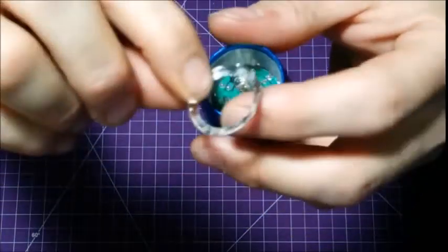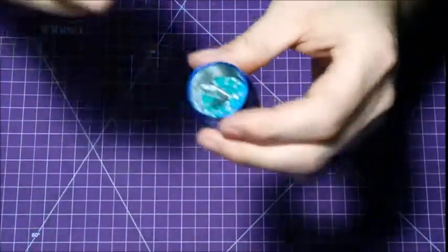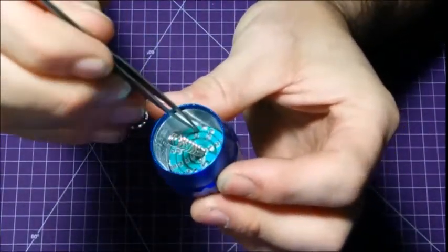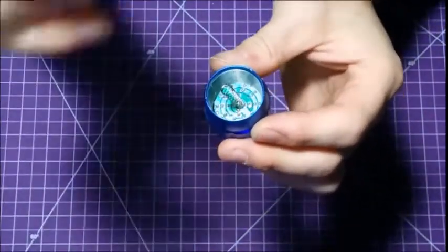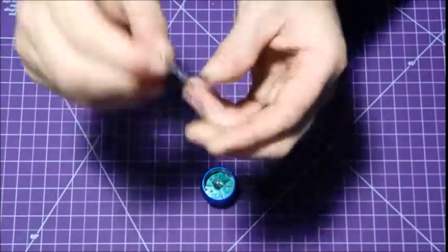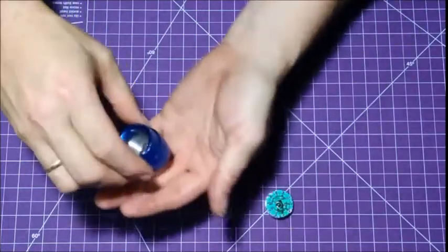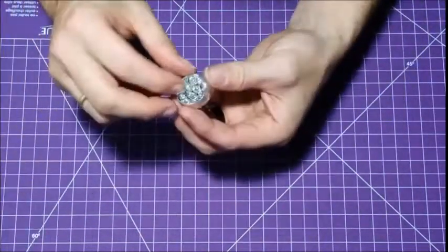Little steel ring. You'll mess it up a little bit, but that's okay. With a little pair of pliers, you can straighten it back out. But it is deep down inside, and it holds your LED board in. So find something like a little hook, pair of pliers, something, a little tiny screwdriver. Pry that out, and then this will come out like so. Don't lose your lens. You can set that aside.